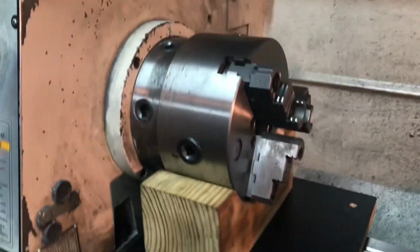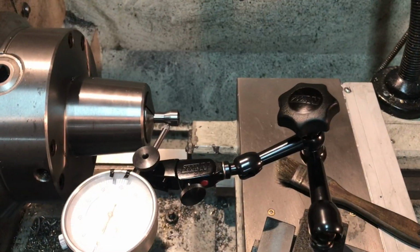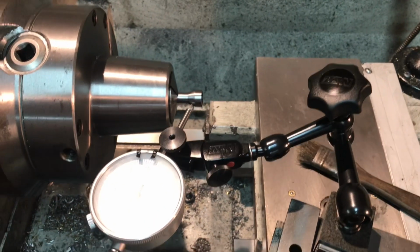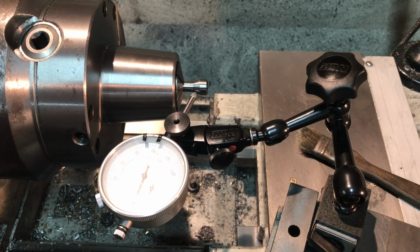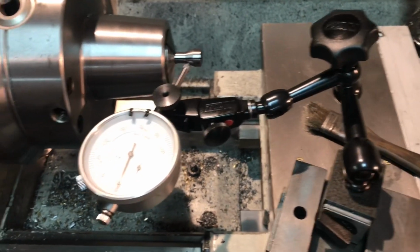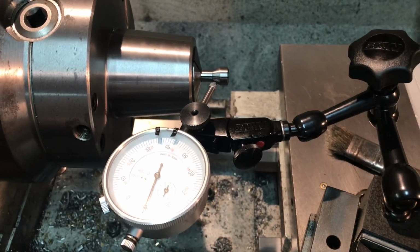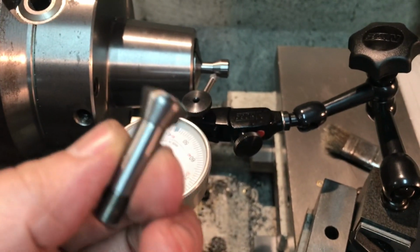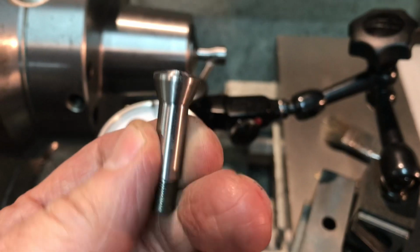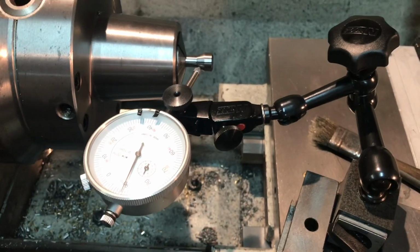So now I'll take off the 3-jaw, put on the 5-C. So here's the setup I was talking about for getting the 20-degree angle set just right. If you saw the needle move, I'm not shocked. There is some variability. I've got it within about a 1/2 thou on that short distance of travel, and I tried it with several of these little WW collets.